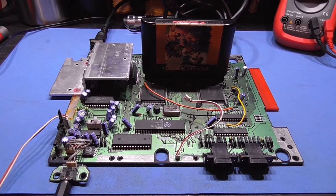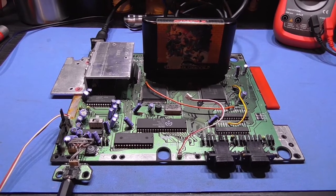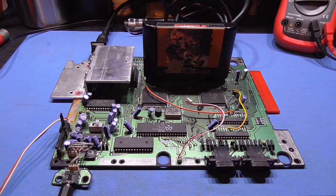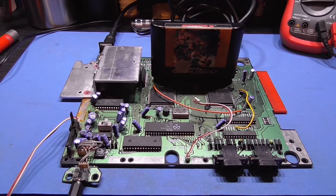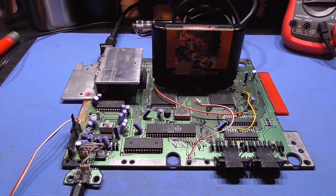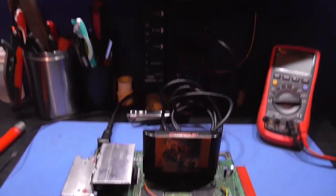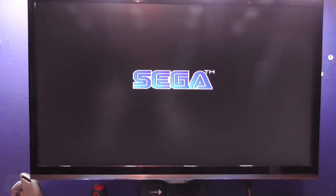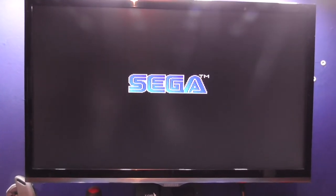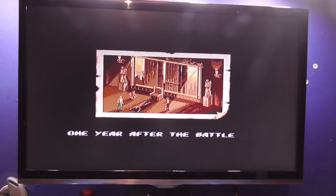It's time to power this thing on. We should get a really crisp, sharp picture now, because we're using C-Sync for sync, not composite video, and it's at the right level, you know, that 1 volt mark I saw on my scope that the TV is expecting. So let's power this thing on. And yeah, we've got it, baby. Now, you probably can't see this, guys, because I'm recording the TV through a camera. But the thing I can notice straight away is that the picture is sharper.